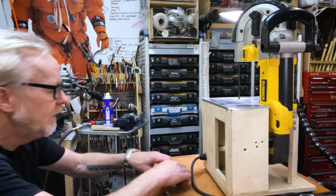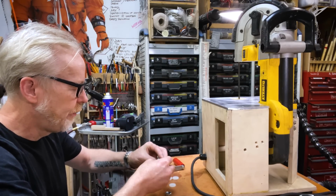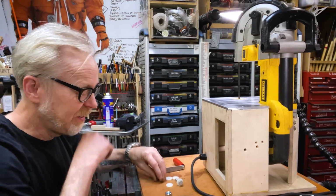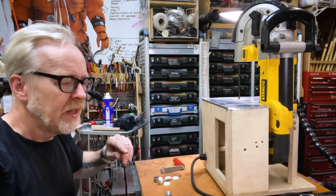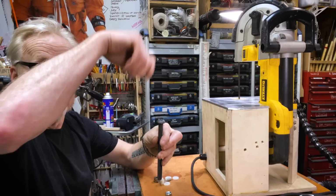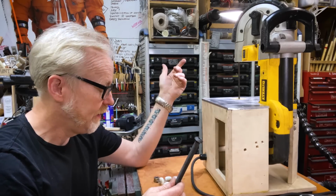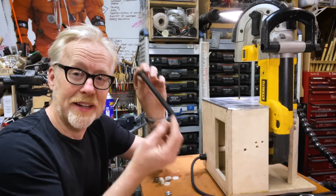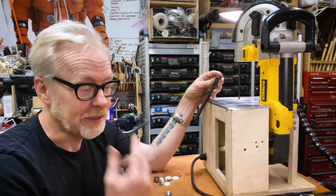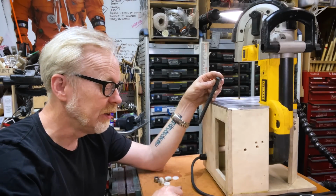All right, I have some nylon washers and some thrust bearings here. And I wanna play with all of this stuff because I'm basically attaching a crankshaft to a threaded rod so I can thread up and down a nut on a yoke that's moving up and down that rod. I could capture that rod at both ends by building a little box for it, but that's a lot of engineering for something I don't think I need that much strength for because it's seriously just a singular downforce.